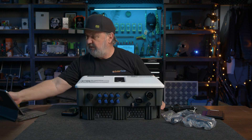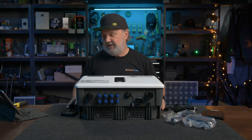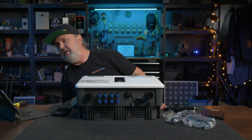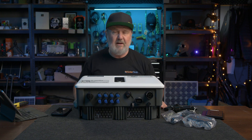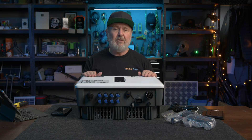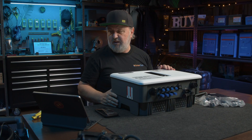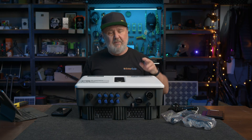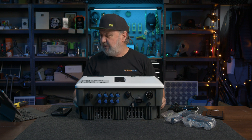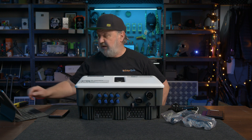Running through the specs — this is the 25kW unit. It's got a very low start-up voltage of 180 volts, so pretty much first thing in the morning this thing will be up and running. It will have a maximum DC input of 1,100 volts and an ideal rated DC input of 620 volts — often that's your target for VMP under operating conditions. The operating range is 160 to 950 volts — the MPPT tracking range — so very broad. Three MPPTs: two singles and a double input MPPT. Maximum rated power is 25kW or 25kVA, with a maximum efficiency of 98.6%.